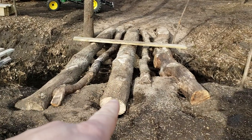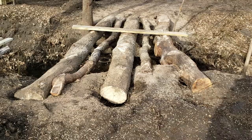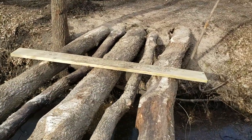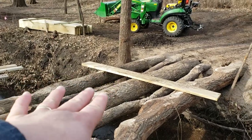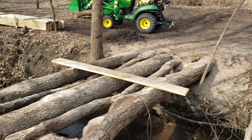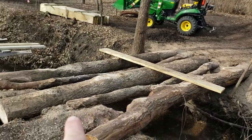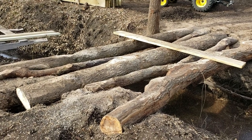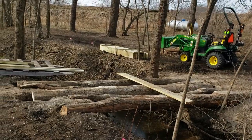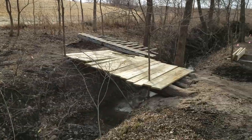It's not impossible I'd find a spot where I really need to get in and move a little more dirt and drop it down just a hair — I've already had to do that a couple of times. My next step will be to throw a strap around the beam, lift it, excavate a little more, and try to drop it down another inch or two. My hope is to not create a low point in the middle, but rather mitigate it so it's all roughly even. We've also got a little low point on one side — we'll shim those. The only way to get away from that perfectly would be to mill the top with a sawmill, which isn't practical for our situation.